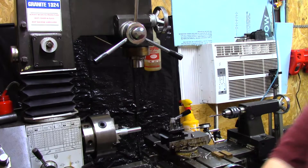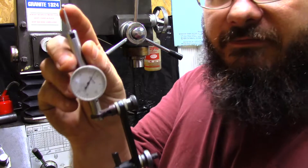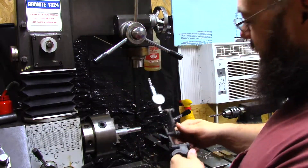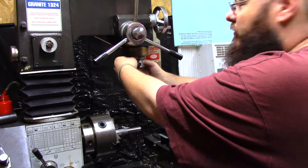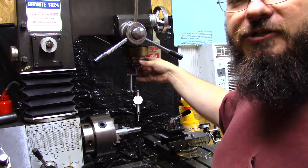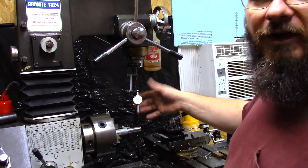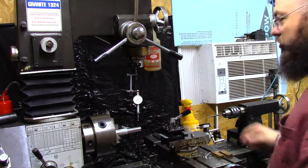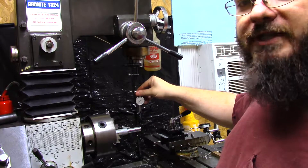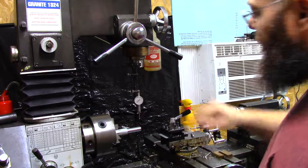The next indicator is an inside hole indicator, and this thing only goes twenty thousandths — very little movement to make that needle jump. It's on this mount here, and what it's for is you actually screw it onto your chuck itself. You want the machine in free-spin mode but not powered on — you want it dead whenever you do this, because you don't want it spinning and messing up your indicator. To find the inside diameter of a hole, you turn this around the inside of the hole, touching one side, and go around until you get it square — that gives you the inside diameter.